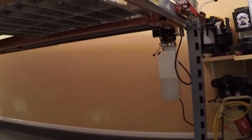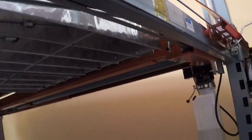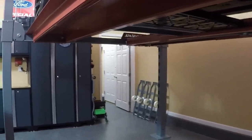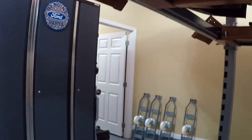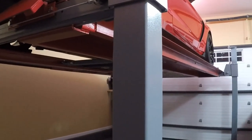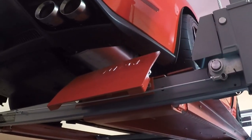The other safety aspect I was looking for was ALI certification — the Automotive Lift Institute — essentially third-party independent testing that proves this lift meets or exceeds the automotive industry standard for safety. For having this much weight this high off the ground, that was paramount to me. For me or anybody else potentially standing underneath with an expensive car up here and now potentially an expensive car beneath it, that was my biggest concern.